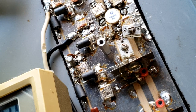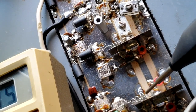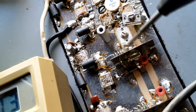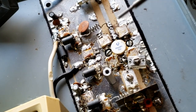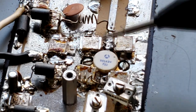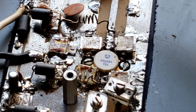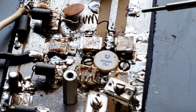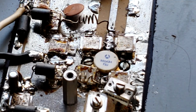On each of these transistors, I've been looking at the collector as close as I can get, and conveniently, this coil supplies voltage to the collector, and it's a good place to attach my probe. Likewise, in the next stage, same coil right at the collector. And the final stage, anywhere along this output is good to pull a signal reference. In order to test the transistor further, I am going to disconnect the power supply off the collector and the power supply coil off the base. Since everything else is connected by capacitors, there is no connection to the circuit other than those 2 points. So by pulling that, I will isolate the transistor pretty much, because the capacitors rarely go bad, these little mica capacitors.